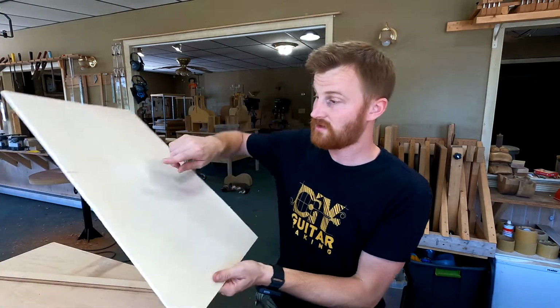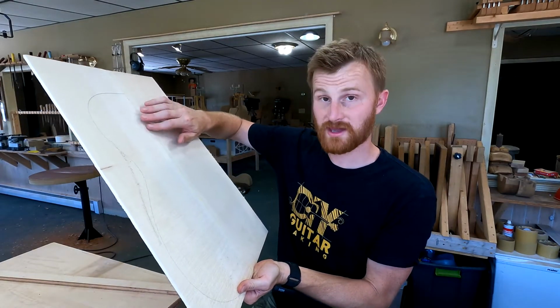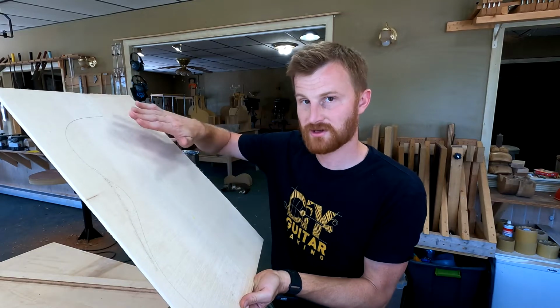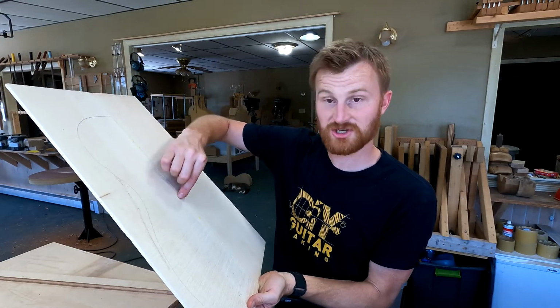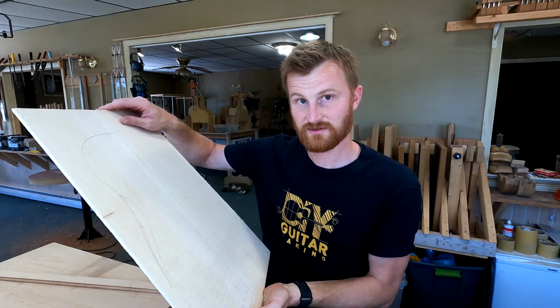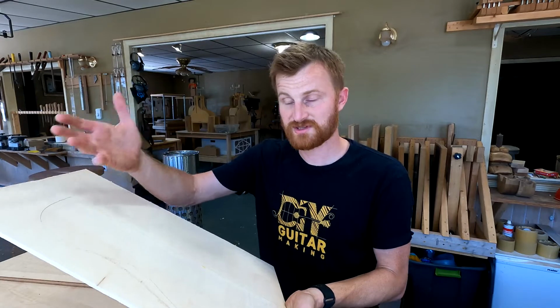And more importantly, it actually makes the joining process a little bit more difficult because the areas where that V connects and those grain lines connect, because the grain line is right at the edge there, it's actually a little bit harder than the white wood between the grain lines. And so when you're jointing this, you will likely find that it's harder to get a nice clean joint without selectively planing in certain areas, simply because those converging areas plane differently than the parallel areas. So best thing, for ease of jointing, is to use the most parallel grain you can get.